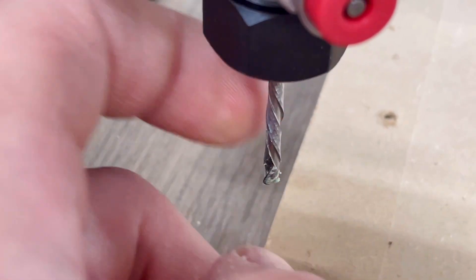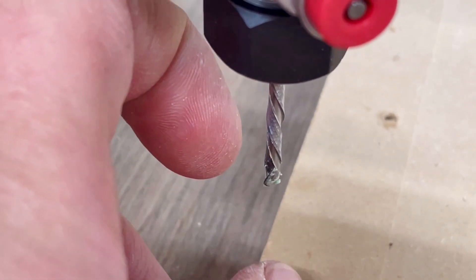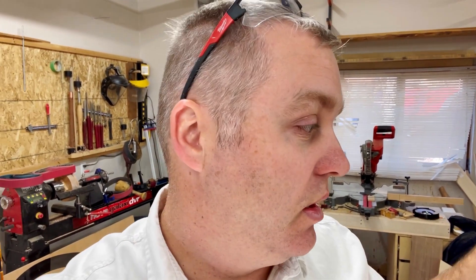These compression bits are really only useful for thinner materials where you're making a full plunge cut, particularly with small bits. There's a brief rundown of why up cut and down cut matters on flush trimming, CNC routers, and any spiral bit basically — it's about the material, how it's cutting, and how it's being supported.